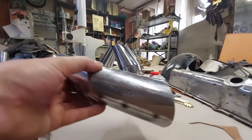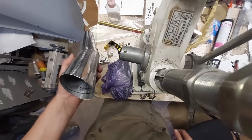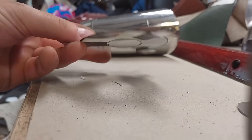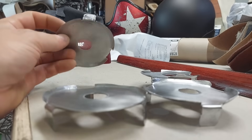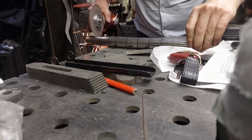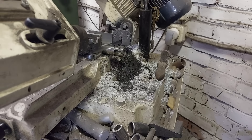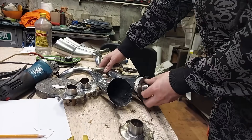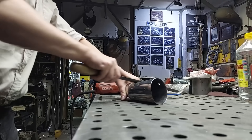We've got some nice cones ready. Any muffler must have some filling inside, so they need end caps to hold it. It's paper, metal work, etc. But here we go, leaving a ton of work behind the scenes to show that custom bike building is easy, quick and no pain in the ass. Next step is attaching some pipe pieces to those caps – the inner ones required some milling. The work seems to progress. I ask Gary to weld those cones, then I rasp, grind and polish them.